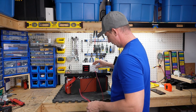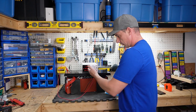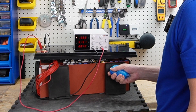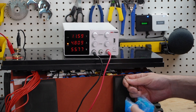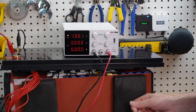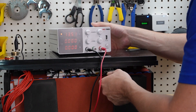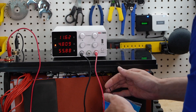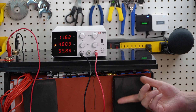I had it set for a 24 volt battery — let me bring that down. We are now charging with almost five amps. Let's stick the temperature probe into the ice pack. Charging disabled — the low temperature protection triggered. Now testing the second temperature sensor independently — and there we go. Both temperature sensors work and they work independently.